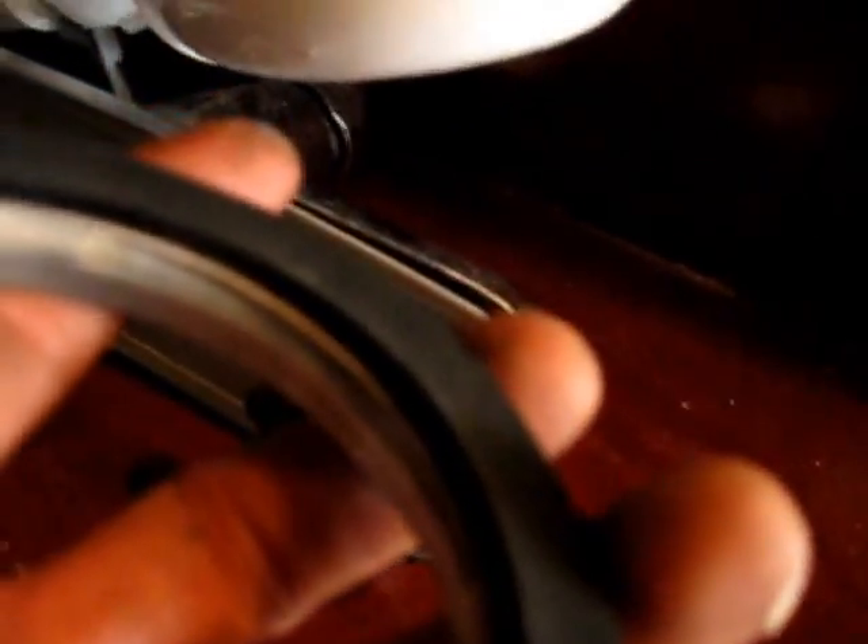The retainment ring must go in as follows: it's got to be the ring, then the paper gasket, then the rubber — and it has to be in that order. Because if you don't use the paper gasket, the ring will stick against the rubber and you won't be able to get it tight, or you'll push the rubber gasket out.